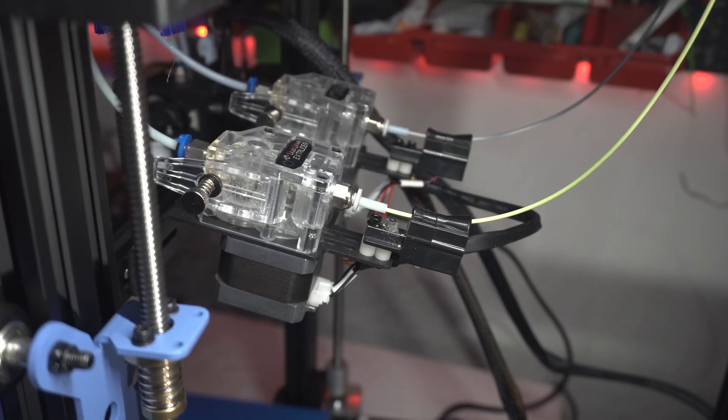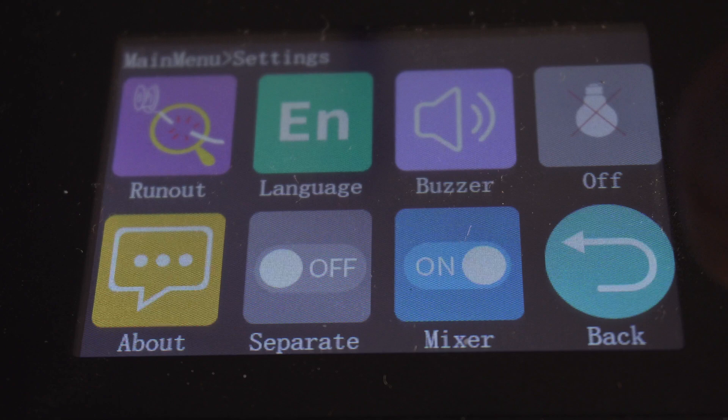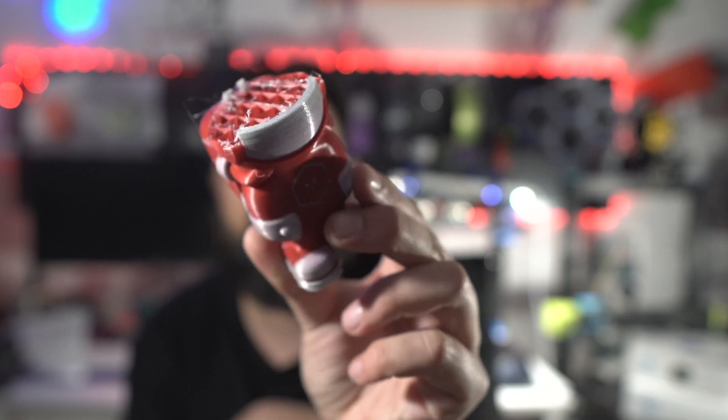The second thing I didn't like is the filament sensor. Filament sensors are there on both extruders, but once you put the printer together, you need to activate them from the menu. It's the first time I've had to manually activate a filament sensor — usually they come active by default. I didn't know that, and I ended up with a failed print: the filament finished but the print didn't stop, and it went on and on trying to print with no filament.